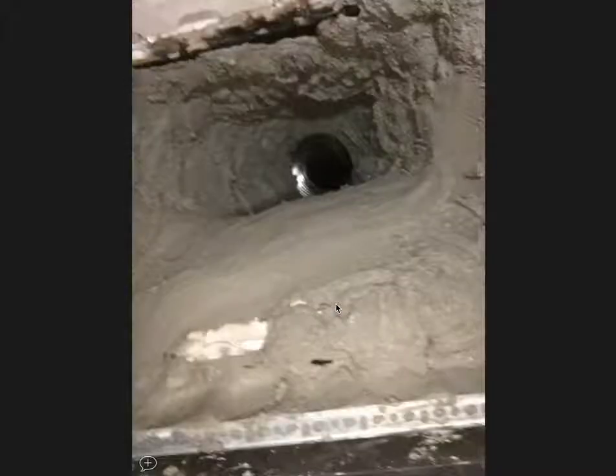This particular one already had a smoke chamber which was pretty smooth. We then come in and start the initial parge coat up to the lining system. You can see our stainless steel lining system at the top which would not meet the required ratio of 12 to 1 because it is round with the fireplace opening.